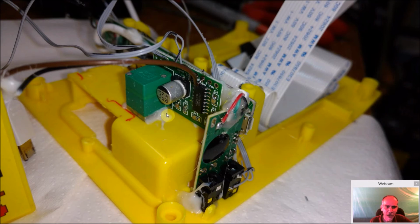And just another shot. Hot glue is your friend. Don't worry about using too much. If you do put something and you hot glue it and you say, oh man, I don't like that, I got to take it out, just heat it with a rework station or even a hairdryer long enough, and it'll loosen, and you can peel off the hot glue and redo it. So don't worry about it if you're using too much. But once you know where it's going to go, put the hot glue on there and make sure nothing will ever come off ever again. It'll keep it really good in place.